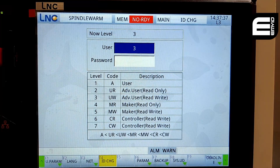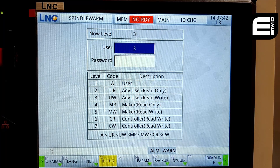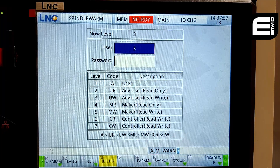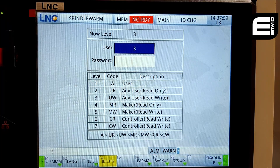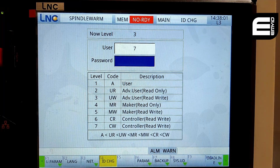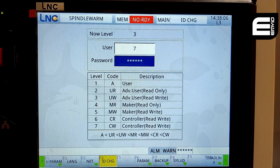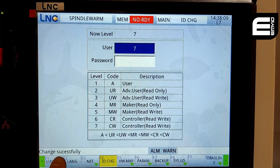This brings up the login screen, and this is where we will be changing the user. To get the most out of the backup, I recommend we use level 7 — and in fact when we are doing the backups for updating the screen set, we will need level 7. So press 7, shown at the bottom as input, and press the input key. The password is 168888, and input again. If you've typed your password correctly, the change will show successful.